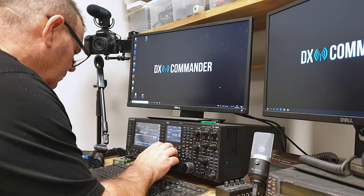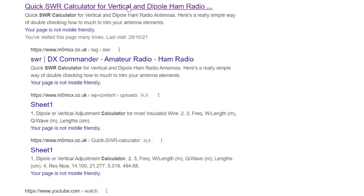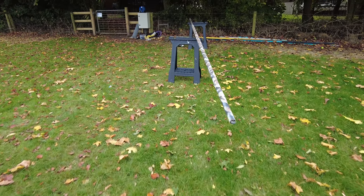I've already laid out my radials for a permanent install — 32 of them here. For holidays I use the same number but just 10 feet (3 meters) long, in bunches of four to six. Once connected, head back to the shack, plug into your radio, and test. In most cases you'll be happy and start working pile-ups. If you need to adjust, you only need to adjust at the element ends. You can download an SWR calculator spreadsheet by googling 'M0MCX SWR calculator' — it tells you exactly how much to lengthen or shorten your element.